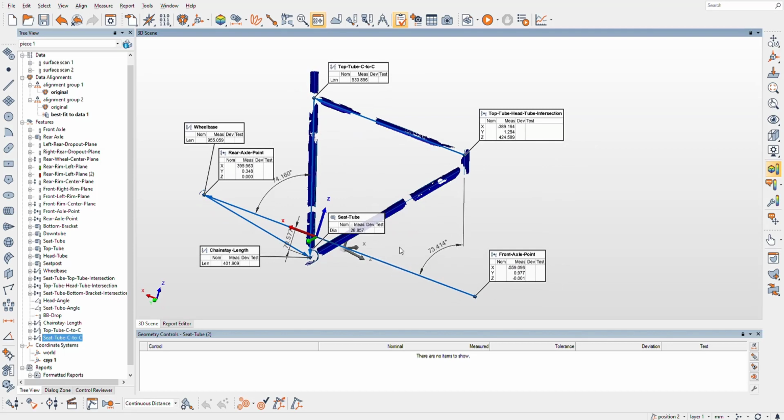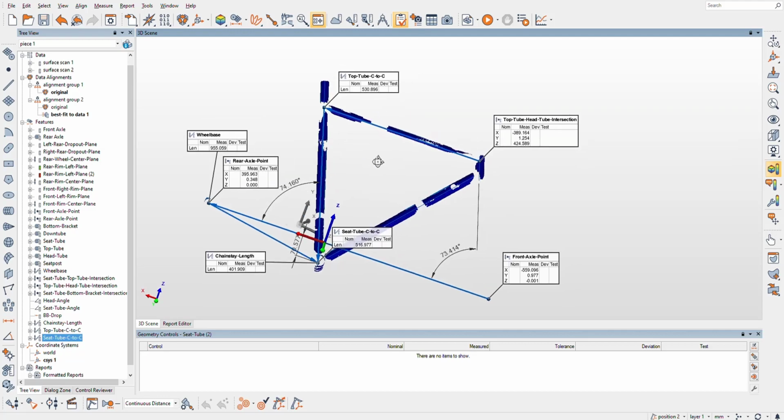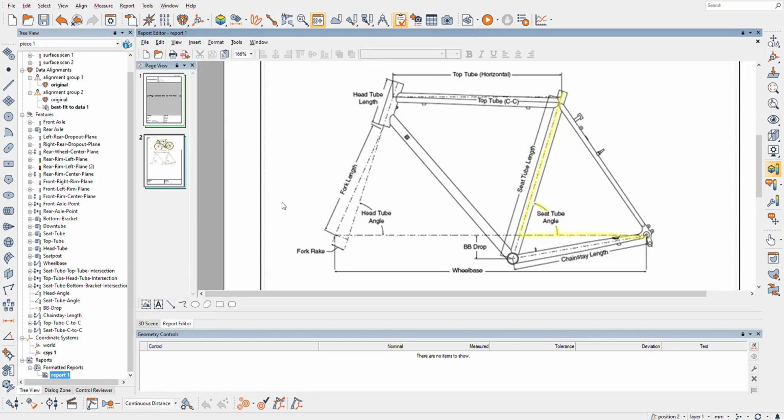That being said, this is really interesting that these angles are pretty close here. This bike was always really twitchy, fast, good for crits, turning corners in a hurry, and just generally pretty responsive. Okay, that's measured. And so we're just down to rake. I'm gonna have to go do a little bit of looking up, probably Google how to measure a fork length.